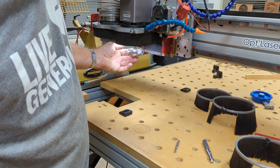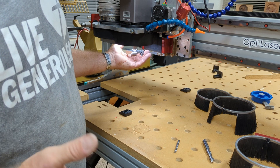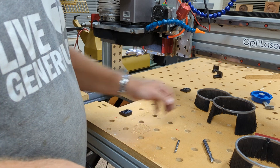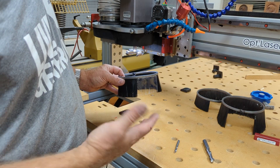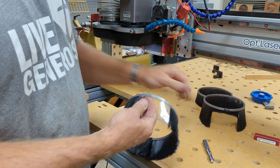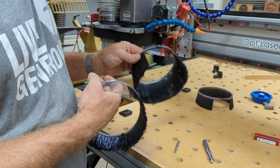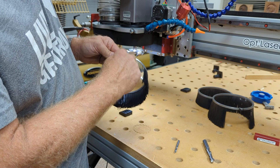The other situation is my two-and-a-half-inch slab slayer for surfacing tables and big surfaces. With this radius at 16,000 RPM that's about 175 feet per second surface speed, so those chips are coming out fast. Generally you're hogging material off as fast as you can and they have a tendency to shoot right out of any hole. For those you want the bristles actually down onto the wood surface to seal it up — I've had cases where bristles aren't strong enough and chips actually shoot underneath and out. So in that case I don't want an open window like I do for the small bits.